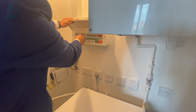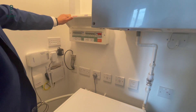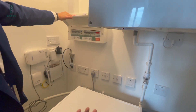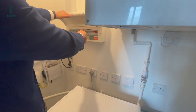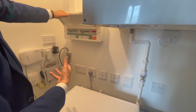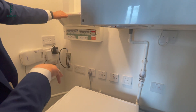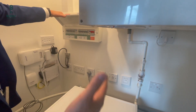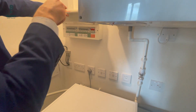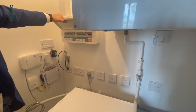To restore the power, just flick the switches back up. Your main trips switch is here, so you can turn off all the power to the apartment by just flicking this down. Occasionally you might find that an appliance has caused a fault — you'd be using a hair dryer or heater, and the power will go out in an area. Come in here and you'll see a switch has flicked down. Unplug the faulty appliance, restore the power. If it continues to come down, go through all your other appliances, switch them off at the walls, push this back up, and switch them on one at a time. The one causing the problem will generally cause a fault again, and then you've identified the problem. If you can't identify it, call an electrician.